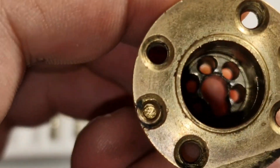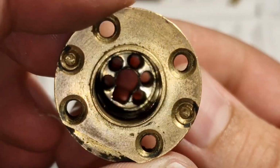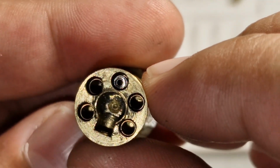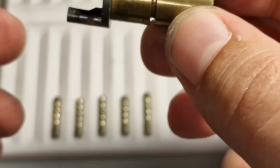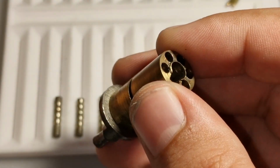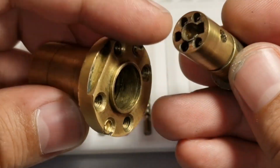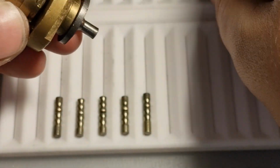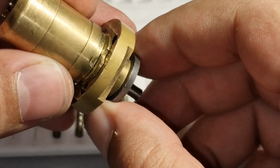Then inside we have the front part of the lock. That's where the key pins will sit. And this is the barrel with the springs. Looks like one of the springs is a little bit different in this case. Probably also some gutting accident. This is not original mine. And what you have to do is to have the key pins lift the drivers above this section so that this can rotate. Holding these together, there's this clip that goes inside this part here and holds everything together.